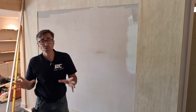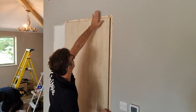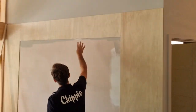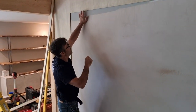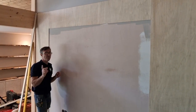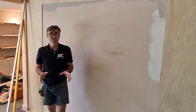So we've hung the door. The door's back on its fancy hinges which enable it to be flush with the wrong side of the lining, bringing it over to allow us to put the cladding all the way over. We'll ply the surrounding wall too and use the adjustable hinges to bring it all nice and true, then go over the top with the slats. It's going to look amazing and be hidden. We've got the plywood on the wall ready for the mirrors. We've ordered 6mm mirrors and this is 6mm Streetech, both going on with adhesive, so on paper they should come up the same thickness. We need to get the mirrors on and then carefully clad around them. I hope you enjoyed this video — catch you all soon.